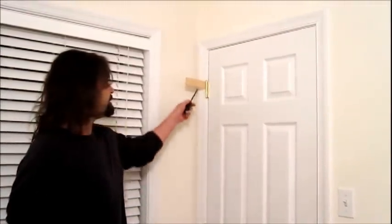We found the sweet spot and now the door shuts. What we're going to do is just cut down that shim. And eventually what we should really do is plane the door a little bit because it's still tight. But that is your quick fix for now.